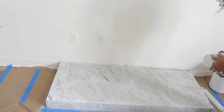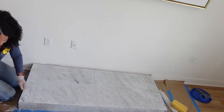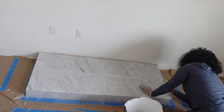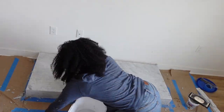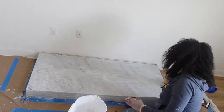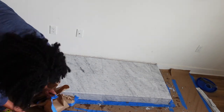It is the next day and all I have to do now is grout the tile, which is another thing I've never done. But I read up on it, watched some videos, and I'm just going to give it a go. I have this pre-made grout in the color platinum. You just spread it on, wipe it off with some water — that's basically it. You need a grout float and you edge it into the cracks, then wipe it off. Grout does dry faster than thinset, so you really have to work quickly. You just shove it in the cracks and wipe it off.